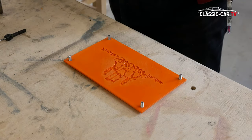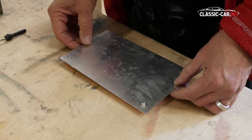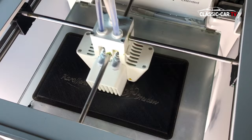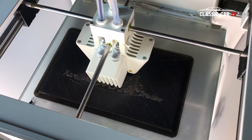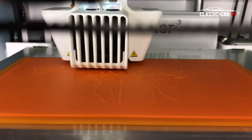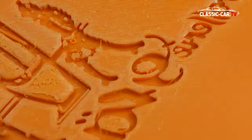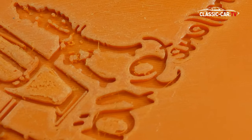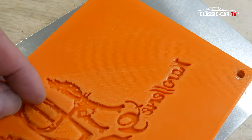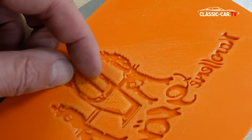To test another complex logo, we printed out two plates in different materials: a plate in nylon with normal resolution, and a plate with high resolution in PETG. The nylon print lacked fine details from the start. The PETG mould is too soft — the driven sheet metal caused pinching at the edges of the mould and the material gave up. The small subtleties have been broken out of the mould.